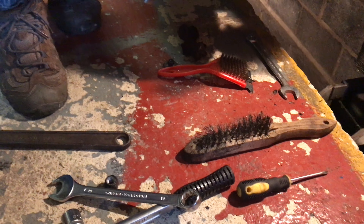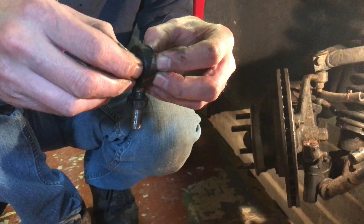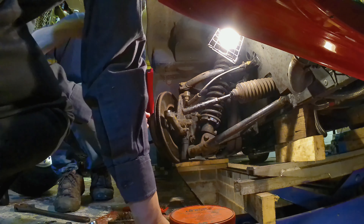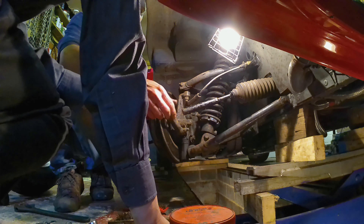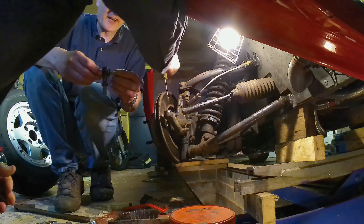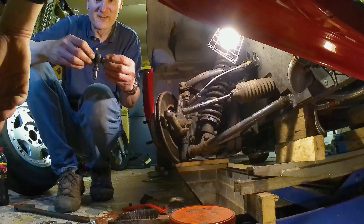What looks like a little bit of play actually makes a hell of a lot of difference. Well it does, yeah. Has it been drilled out or has it got a taper on it, that's the thing? That's been drilled out, no taper on that. And then the other thing is you can just pop that down and you can feel it. Really that shank should have been further down there so it went into that as well.